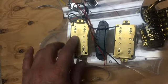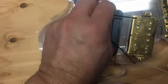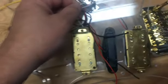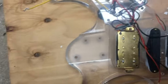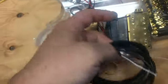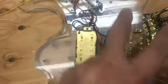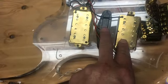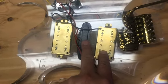I think one pickup will cost more than this whole guitar that I got, and it is only a 2-conductor wiring. It is shielded though, so I'm gonna have to change it out to a 4-conductor wire. Basically I have here a 4-conductor wire, so I'll be converting the wiring of these 2 pickups and getting the true inner coil, middle coil, parallel humbucking sound in the 2 and the 4 positions.